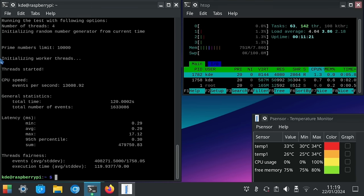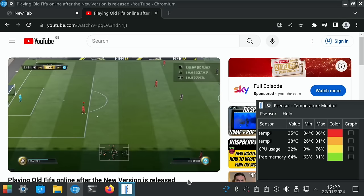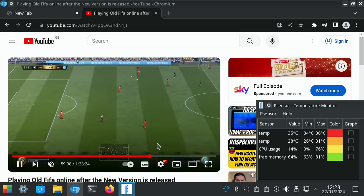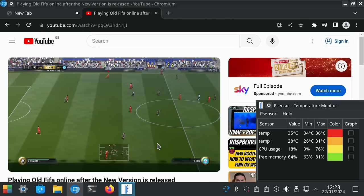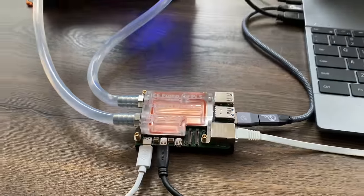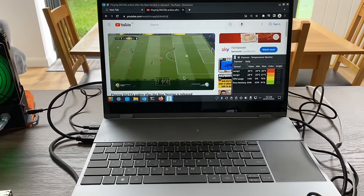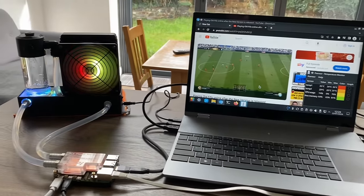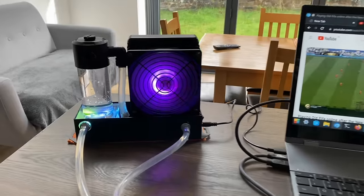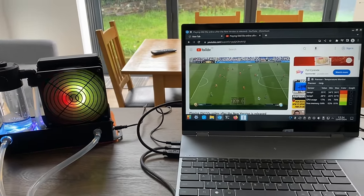Remember it is five degrees hotter in the house now - I deliberately turned up the heating to give it more of a test, and it's still only 20 degrees ambient. After one hour of running a YouTube video, the temperature has only reached 36 degrees, which is super impressive. This is by far the most effective cooler I've ever tried on a Pi, but that was to be expected. Thanks very much to Seeed Studio and 52Pi for sending me this to test. I know it's big and very overdone especially for the UK, but if you're in a hotter environment or have a cluster of Pis, maybe it's for you. It would also look great on top of an arcade build. Please like and subscribe.